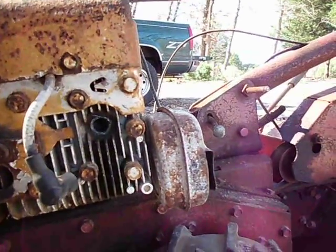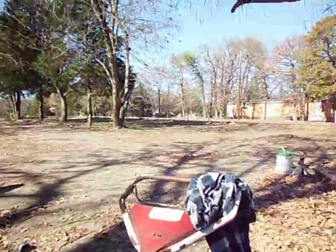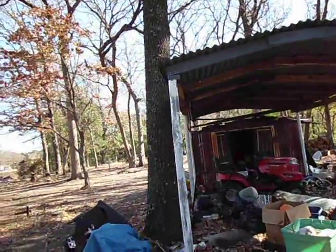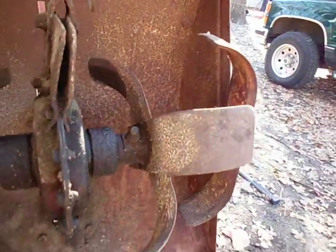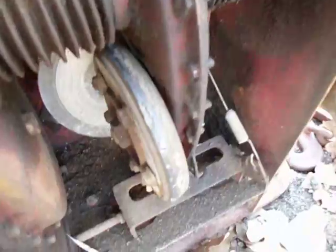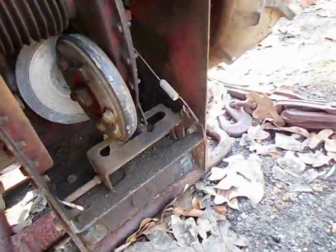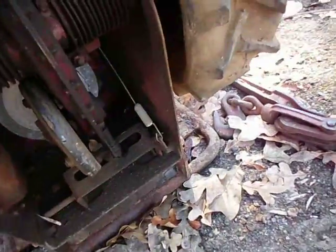So I think that engine's probably just junk — it wasn't in the greatest shape back when it was running. But the deal is, this tiller — these are designed to actually sit up on my nose like that. You can see the tines are still in really good shape. There's a little bit of leakage around the gearbox in the back — the tine box — and a little leakage around the rubber bung plug. The clutch is dry rotted. But all in all, other than the engine, this thing's in pretty decent shape for being as old as it is.